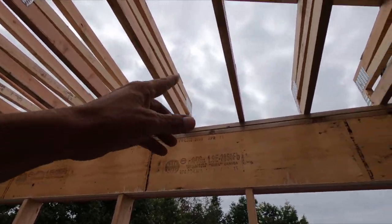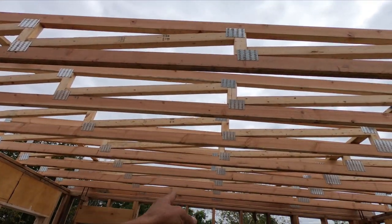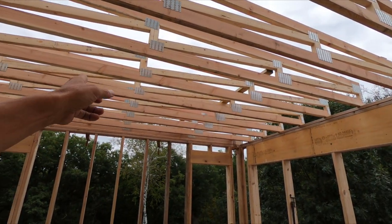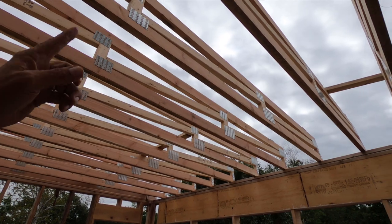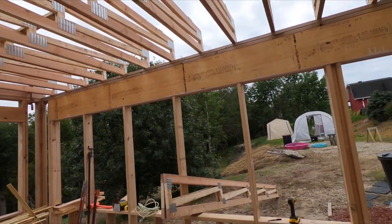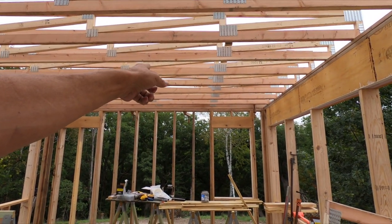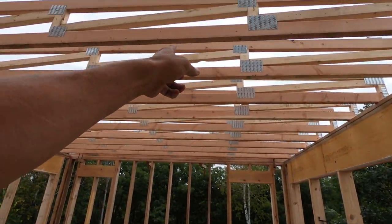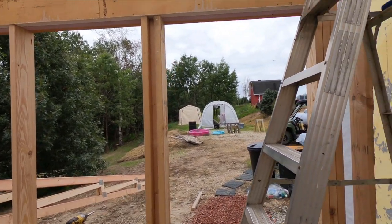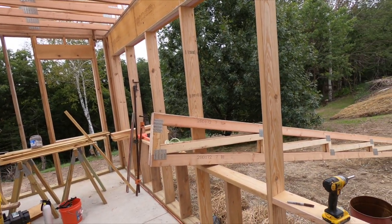And between the rim boards and the bracing that I'll be putting in, I have to get the bracing in. It's 20 feet long. I have to slide it in here, lay out where each truss goes, slide it in here, and get it in place before I cap the far end. Same thing goes with this copper pipe. Before I close off that back end, I have to get that long stuff in here, because there's no way to get it in once I cap that off. So let me get going on this copper, and then I'll be back to put these last couple trusses in.